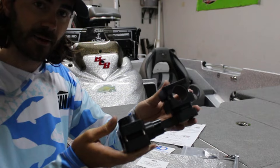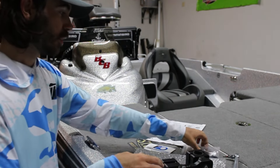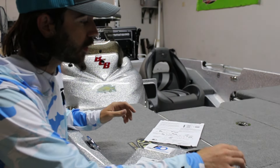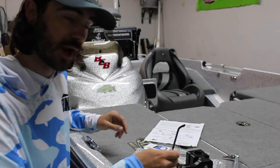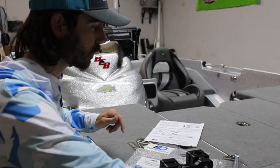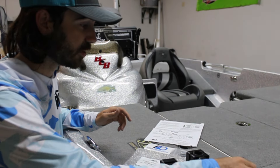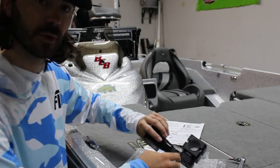Here's what you'll find out of the package: your actual Dominator mount, a sticker, some hardware depending on which transducer system you use, and your installation guide. Tools you'll need are a 5/16th Allen key — which normally comes with your LiveScope or Active Target — a half inch deep well socket, and preferably a torque wrench that does inch-pounds. If not, you can crank the bolts down with the standard Allen key, but there are actual torque specs on these bolts for optimal results.